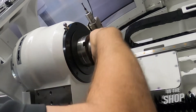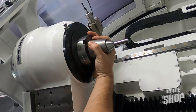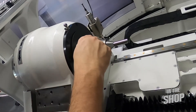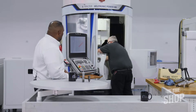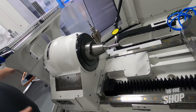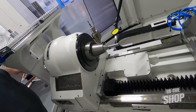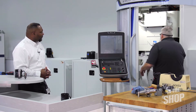I'm going to spin this up close to being tight, and once I get it in here, I'm going to take a blank the size of my collet and place it in the draw tube. Like we talked about earlier regarding springing the collet, we don't want to over-tighten past the point, so the blank tells us how far to go. Once I have it tight and I can't move the blank, I'm going to back it off a quarter turn. Now I can take the nose cone and tighten it — snugging up the bolts. I'll place it in position so that when I'm indicating, I'm on the high point of it. The A-axis will spin and the indicator travels around the blank to check for run out.